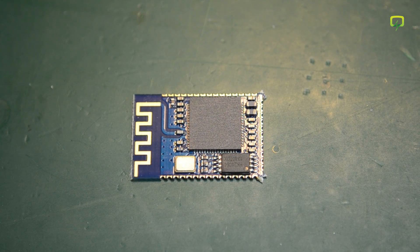Here we have another Bluetooth module, this time one that's specifically designed for audio designs like Bluetooth headsets, Bluetooth speakers and things like that. It uses the CSR8615 chip capable of Bluetooth 4.0 with mono audio output. It's quite a versatile chip oriented towards Bluetooth headsets and you can clearly see that from its list of features. It has built-in lithium battery charger, audio decoding, audio DSP capability, echo noise cancellation algorithms, etc. This module was $5.50 shipped from AliExpress.